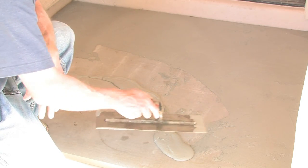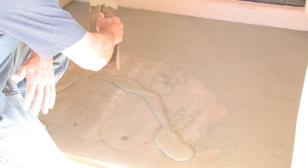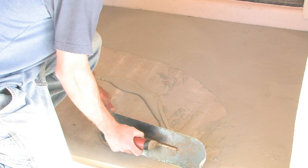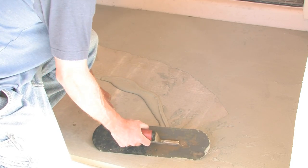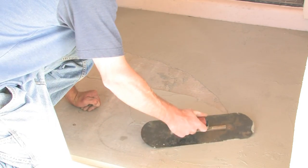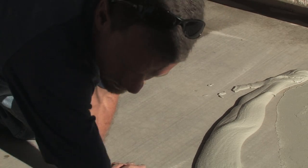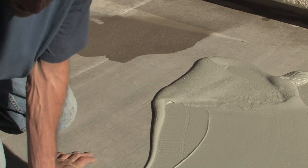With my square trowel I do all my edging, so I'm careful not to get it on the house. Then I use it to get a nice even spread. Once I've got my spread, I use the other trowel for my texture. You can go rougher or smoother textures, but you've got to be careful when the temperature is really hot because it will want to set up on you real quick. I use my square trowel for corners or just to get a good spread — spread it out nice and even.